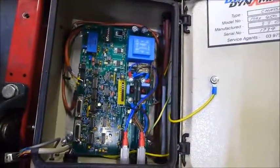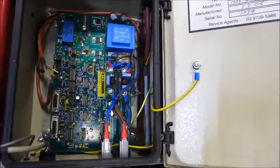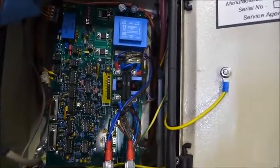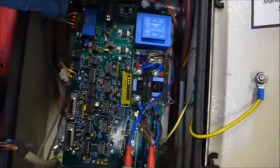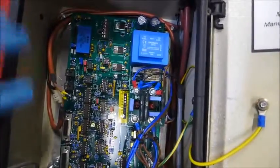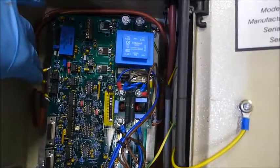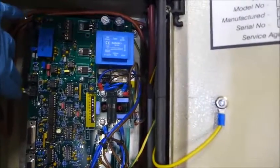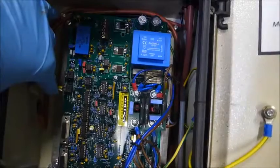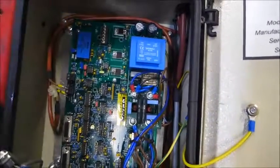I'm going to start pulling apart the Anodynamics original board, just to show you quickly what's going on. The inputs I've pulled off already - this one was to your old load cell; you basically just match the wire colors to what you've got on the new board. I'm installing a new load cell on mine but you don't have to. The input for the thermistor is the emergency shutdown if the retarder overheats. And these are the speed sensor wires from the rollers - there's two different styles, a two and a three wire. Mine is just a two wire, so on the Mainline board you just hook them up to the signal and ground wires.